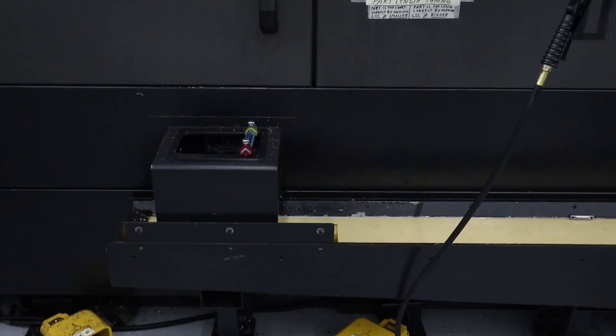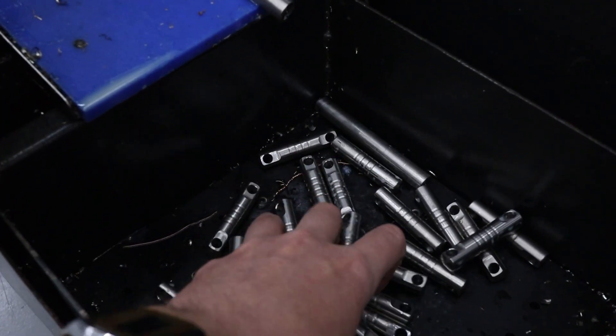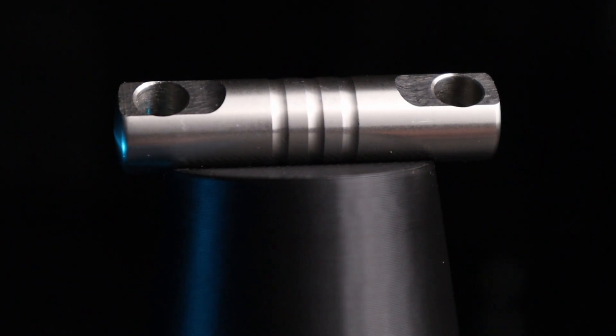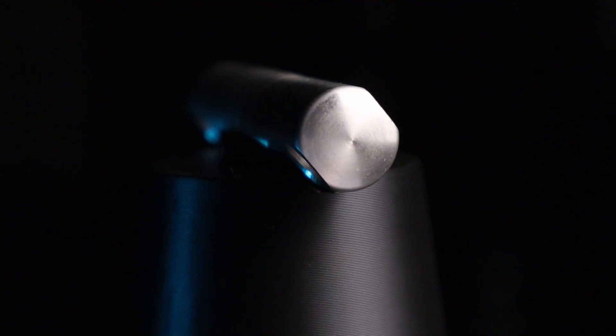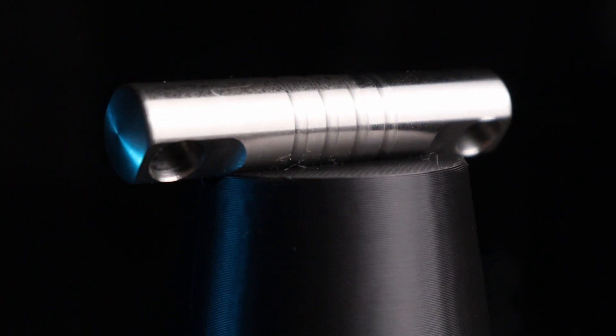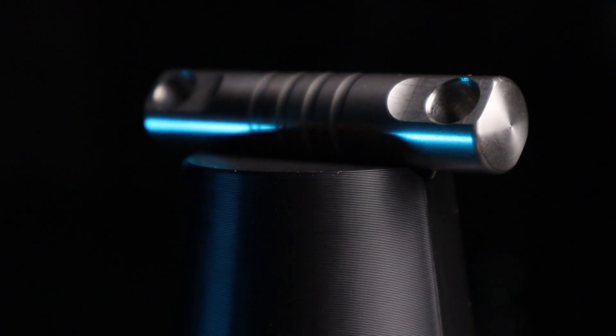Part's done. You can run that in a loop as many times as you want. I set the part counter on the machine control to a hundred — I'll probably end up making more than a hundred. The parts spit out of the conveyor belt and land in this bucket. This is the old version: it's got three ribs in the center and the center-to-center spacing of the holes is 38 millimeters. This new one has four ribs in the center and 45 millimeter on-center spacing. It's for a new addition to the Stay Slayer tool that allows people to hold taller chainstays for bottom bracket mitering. I think this was pretty successful — I got the parts running and already made 35 or 40 of them, and I was able to edit most of the video in that time. Thanks for hanging out today.